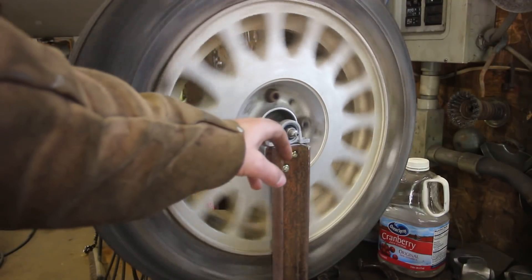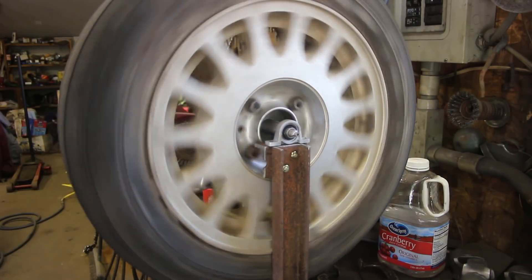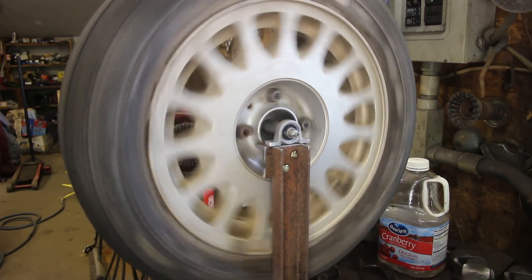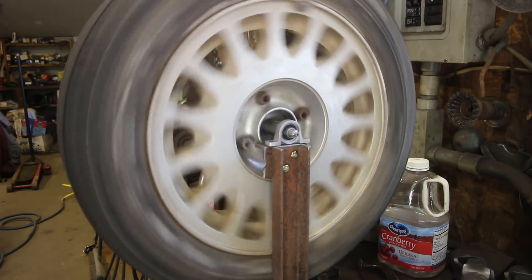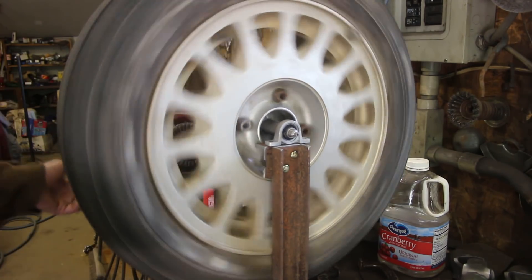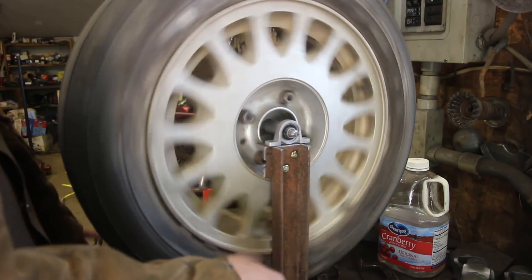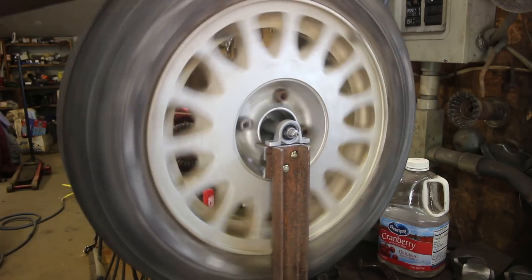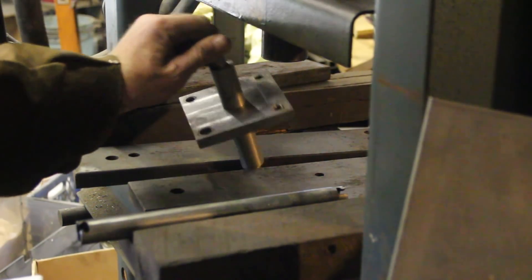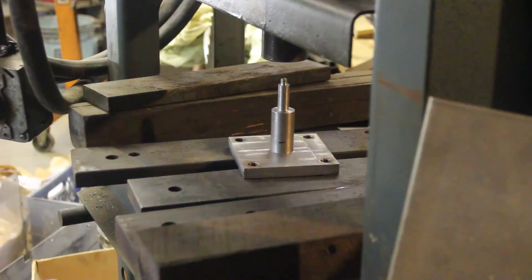I think I'm going to try to press the shaft through to the plate a little bit more to see if I can get the wheel better centered. I have less clearance between the wheel and my uprights than I had hoped for - I basically messed up on my measurements. I measured the width of the tire - it was about eight inches, so I thought I'll make it ten, plenty of room. I cut the bottom piece to ten inches, which means since the uprights are an inch wide, I've got basically no clearance. But as you can see it runs true enough that it doesn't matter.